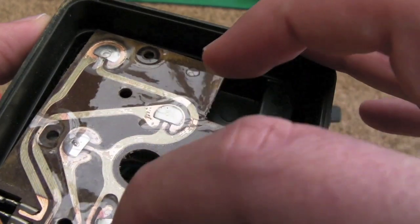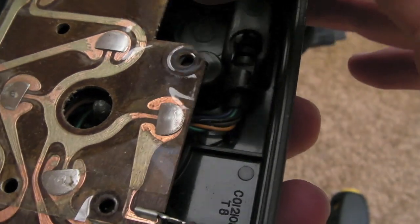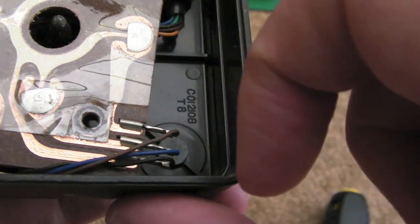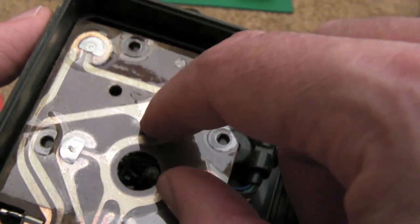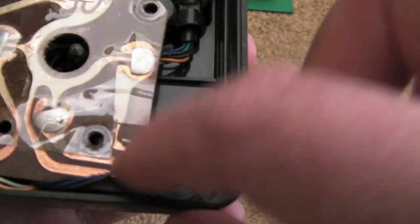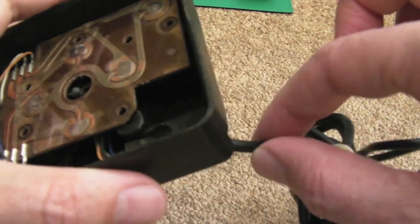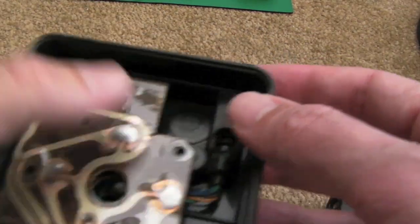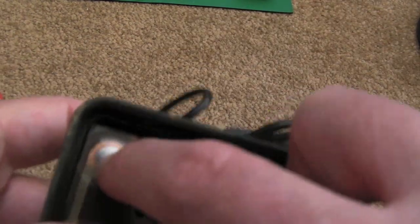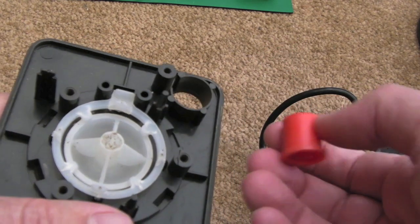They're not too bad actually — pretty clicky. That one there is a bit misaligned but it's still centered with regards to the trace on this side, so that wouldn't cause a problem. I'd forgotten — the connections are crimped onto the PCB. What I'd suggest with one of these is peel the covering back, clean the pads on both sides, and make sure you've got good connections. These are also prone to wire breakage at the entry and exit points of the cable — either near the joystick body or near the connector. The wire on this one seems fine; it's just the fire button. I'll take all the plastic parts out next.